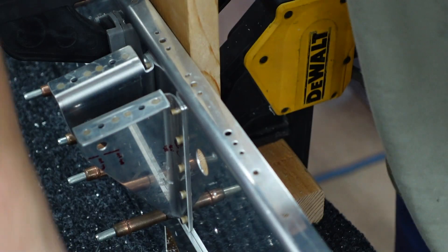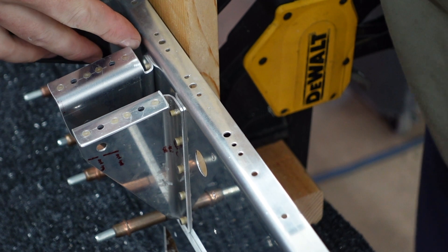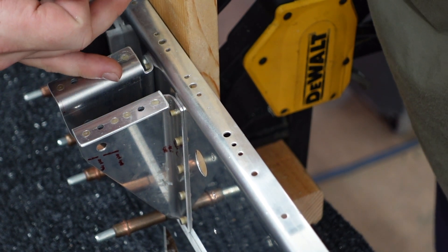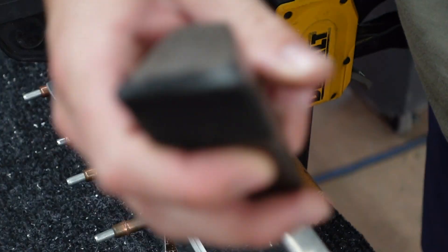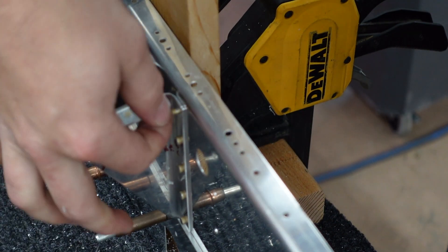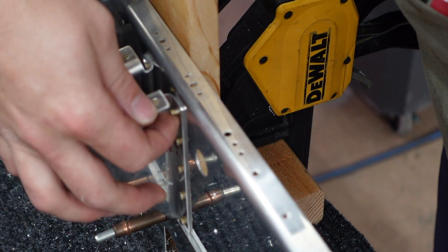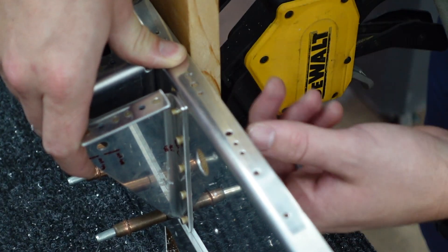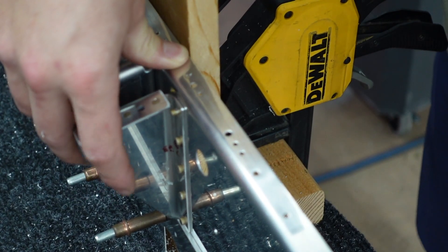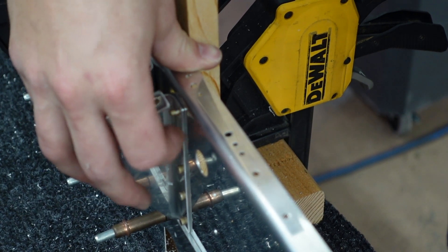I've had this bucking bar and the good old tungsten bucking bar, and I just can't get in there. The first one went fine — I did not have issues with it leaning over, I think it was out of sheer luck. This one, like I had worried, it started to lean right away. So I've already drilled the manufactured head side off, popped it off, and now I'm going through the struggle of getting it out of there. I'll pull that out and then reassess how I want to get this rivet done.